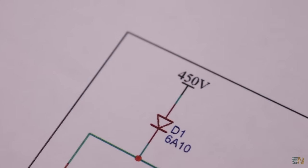And then I solder all the resistors for the first and second stage. I also add a small BJT transistor for the second stage. Then I add all the LEDs, but I don't solder the infrared LED and the phototransistor for now, because we will do that after we add the coil. The next step is to add the thyristors, and they have the pin connections labeled on the PCB, so don't put them backwards.